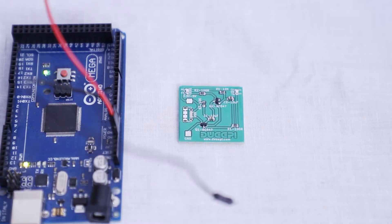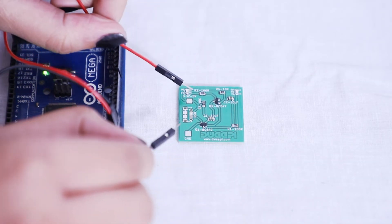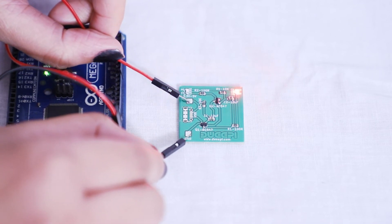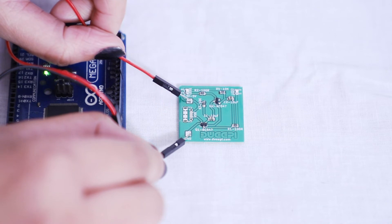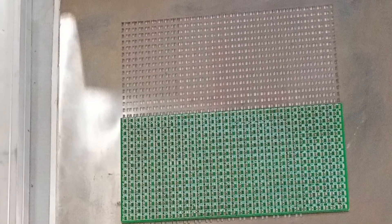Take out the PCB and your PCB is ready for testing. Test the sample circuit by giving 3.3 volts to 5 volts power supply and it shows blinking lights. Take care of LED polarity while placing them on the PCB board. Instructions are given in the document.